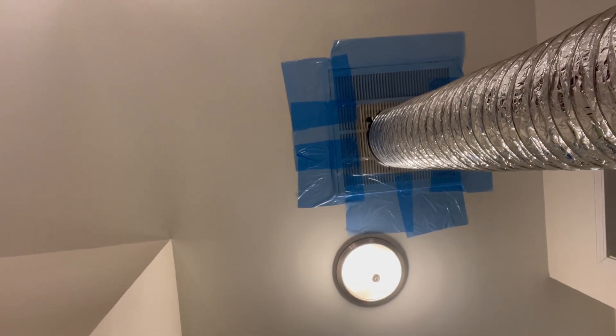At this point we have all of the ductwork masked off. We're using some of the vent cover boxes but I don't have enough for all of the registers in my house, so we've taped a bunch more. There's our primary return — it is the one closest to the air handler. It does not have a filter in it; my system has a large media filter at the air handler. Everything's closed up and I'm running the duct leakage test by itself.